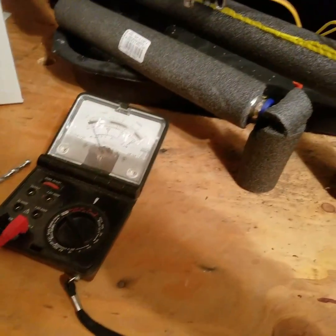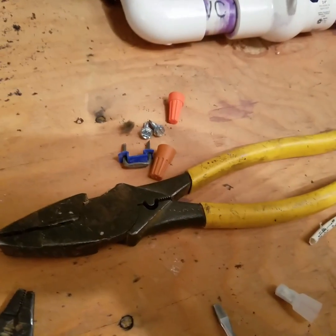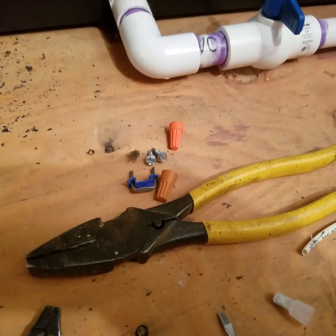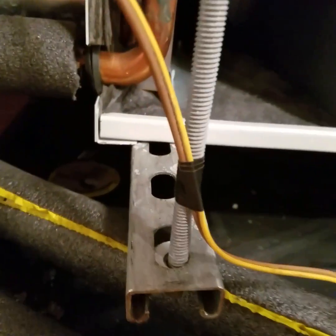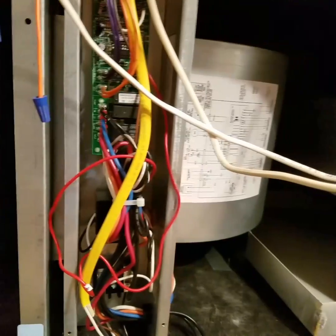Other things you'll want: a voltmeter, a good pair of wire strippers, and a tiny screwdriver for working on those terminals. You'll also need wire nuts. If a wire won't attach well, after you've twisted it, fold it over on itself before putting the wire nut on and it'll hold it tight. Also, I've taped this wire onto the threaded rod — the threads are sharp, so I've wrapped tape around there a couple of times to act as an insulator, then taped the wire on after, because over time it could chafe through and short out, which will burn out your transformer.